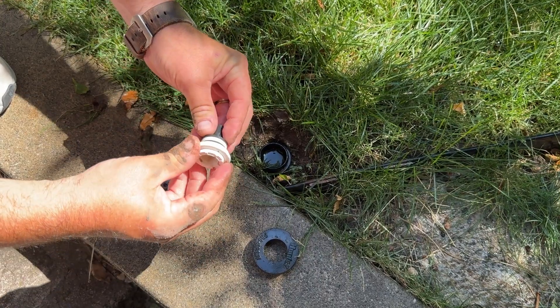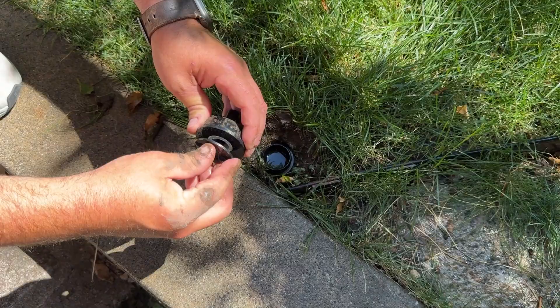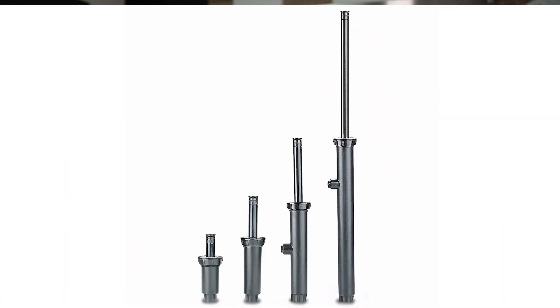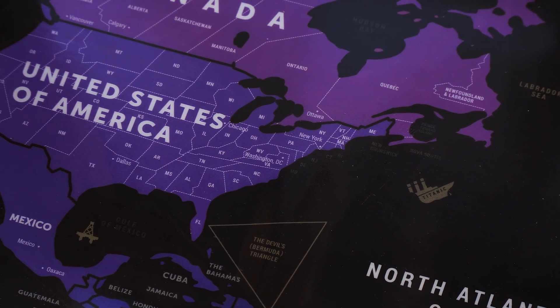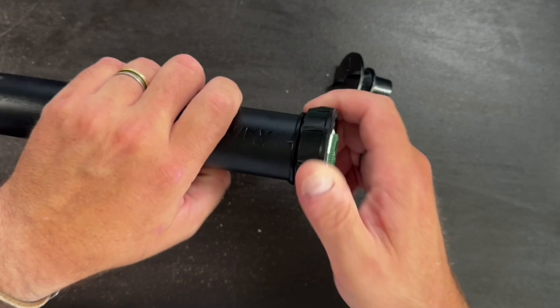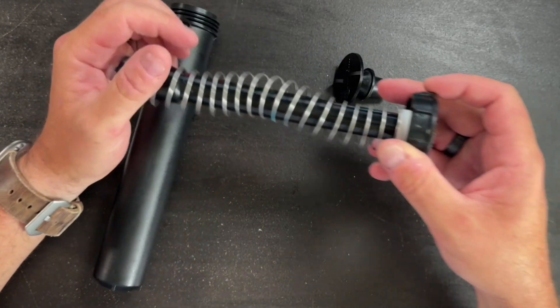I've already pre-recorded capping or plugging five different sprinklers. We're going to start with the good old Rainbird 1800 Sprinkler — very popular sprinkler — and again, it doesn't matter if it's a 3-inch, 4-inch, 6-inch, 12-inch, or it has a side inlet. However, depending on where you are located in the country, if you're in a northern area, you may want to unscrew the top while winterizing your system to flush that water out. All you're going to do is unscrew the top of your sprinkler and pull out the guts.